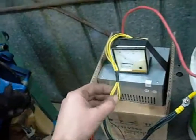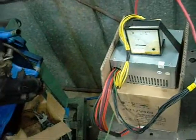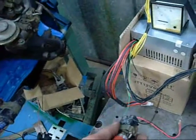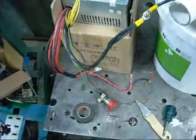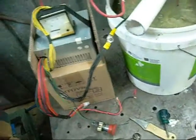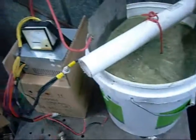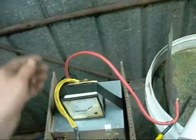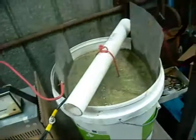So overall: colour code your wires, get all the yellows and blacks together, green and one black as your on. Use a normally open or closed switch — whatever you want — open the circuit to switch it off, close the circuit to turn it on. It's not a momentary switch like the power-on button on a computer — the motherboard has an SCR or something like that to maintain power. On this unit you want to short the two wires to keep it on, and as soon as you open the circuit it shuts down. It's not warm, nice and cool. I don't see any reason why the 5 volt rail wouldn't work, but 12 volts is better than 5 volts for electrolysis.